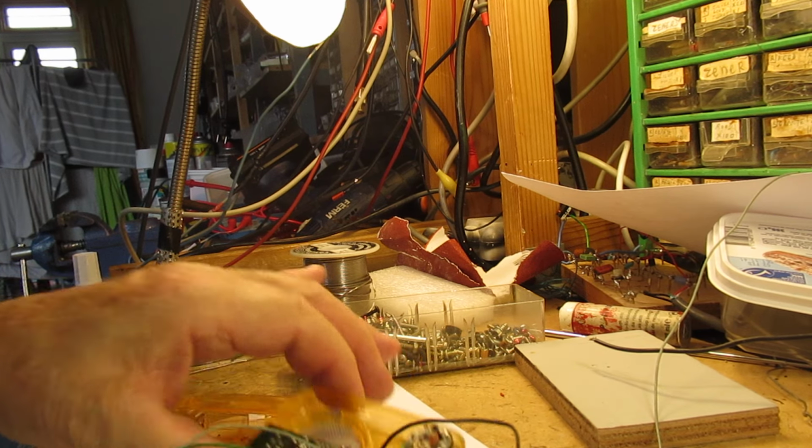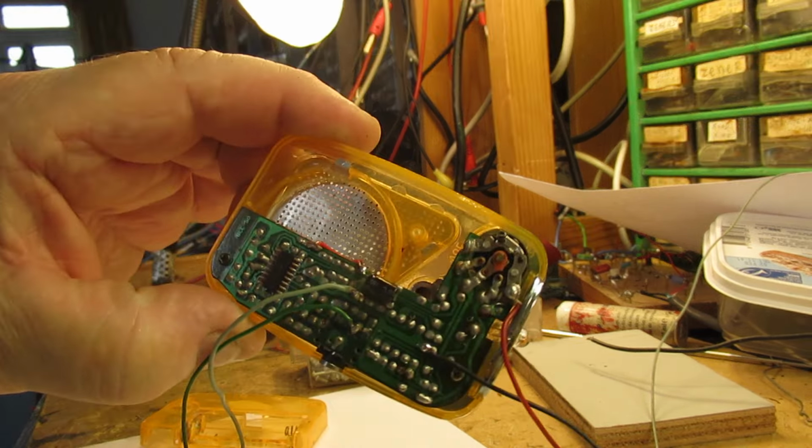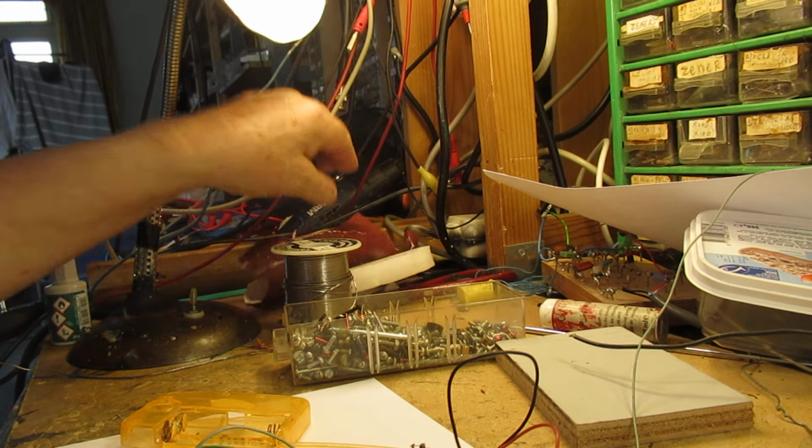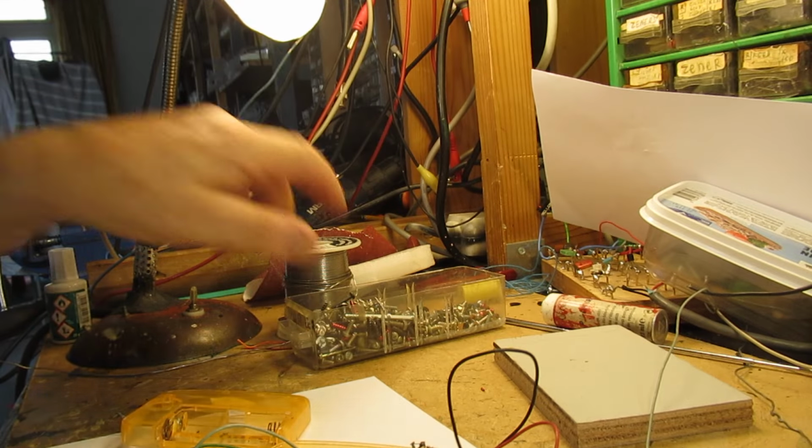In these tiny radios we have beautiful chips. This one, for instance, and there's also one on the other side. I cannot show it because I have to loosen the screws. Intelligent chips developed in the 1970s, early 1980s, and they have in this chip here a complete FM receiver, for instance. And here on the back side there's also a chip for the audio amplification. And here the speaker, of course, the original speaker was made from plastic. It had a plastic cone. Well, I cannot find it. They are very, very common. They are very flat. And that cone was also more or less damaged anyway.